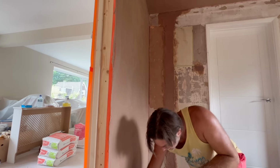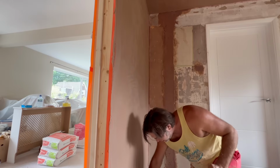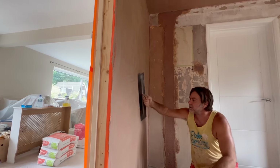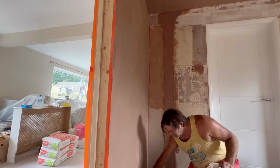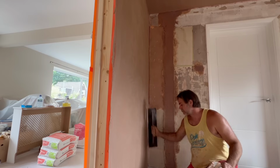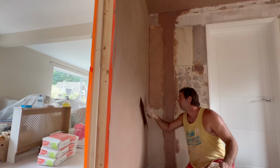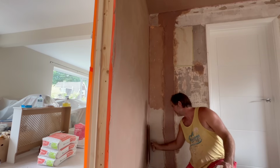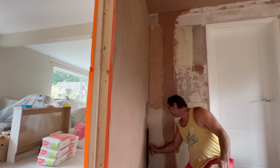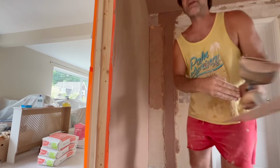Then we can hold it flat up. Put a little bit more pressure on the back of the trowel. We're always chasing that discrepancy there. Not leaving any trowel marks. Although we are having to move fast and we're not far away from disaster as far as time is concerned, we are still in a comfortable position to keep up with all this, so I can't chat too much.